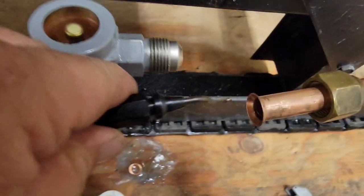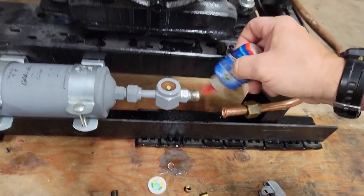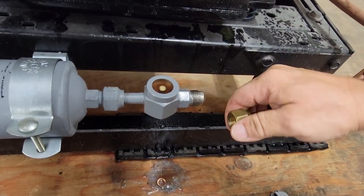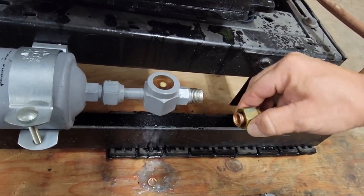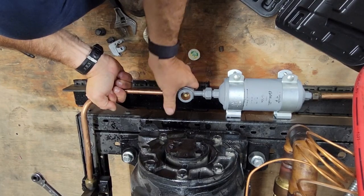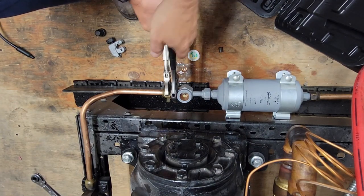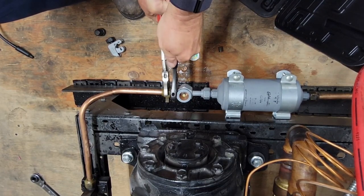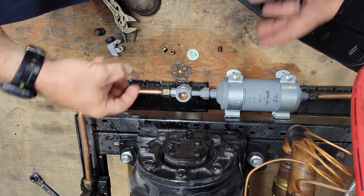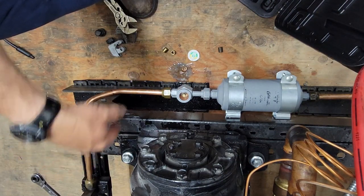That's why you've got to be really careful when you're doing your deburring. But it would help if I wasn't crammed right in between here. I put a little bit of refrigeration oil in there — it doesn't matter if it gets inside. The whole reason for it being blue is that it is made out of polyester oil. That's on the back side, so now it's going to spin like it should. Put her back together — nice mating surface. Screw it together, go out and grab your torque wrench. Less is more; usually about 35 to 40 pounds. The biggest thing is having a good flare and having it lubricated. We could do a little purge over here to this flare nut, but we're going to be fine. Let's go ahead and open it back up.